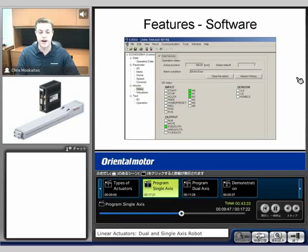We do now a monitor. The first thing that we can monitor is our status, which is very useful when we're setting up the actuator. We can see which inputs are turned on, which ones are off, which outputs, which sensors are turned on and off — so we can make sure that everything's working properly before we turn on the machine in full function.